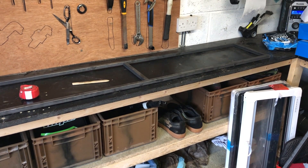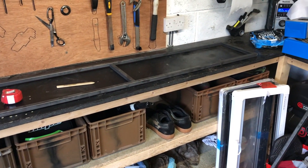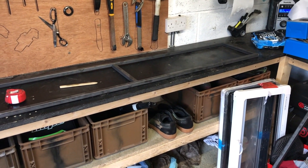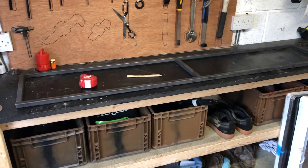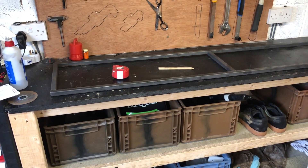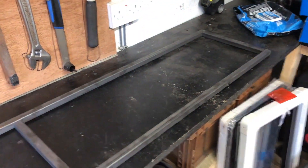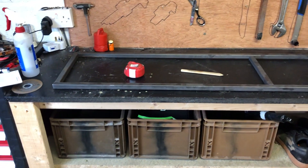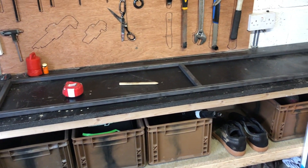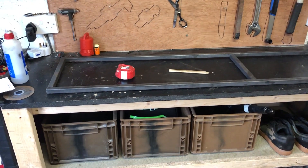When made up these are half the weight of a plywood cupboard that you'd normally put up on the ceiling of your van, so it's a bit misleading. I know it's steel but it is actually lighter, and it's a lot easier to weld than aluminium. They're all butt jointed, pushed up tight, and then we'll use an arc welder and weld it up, make sure it's all square. Then it's just to drill a hole through and fix to the plates I've put behind all the beams in the ceiling of the van.